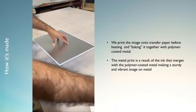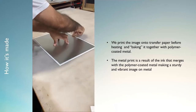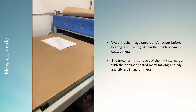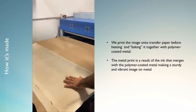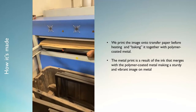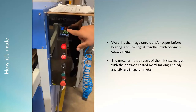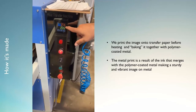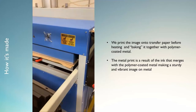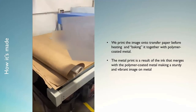Here you can see that he's taping down the metal to the paper so it doesn't move when they're being pressed together with heat. He's putting it into the machine and covering it, making sure the image doesn't get scuffed up during the process — really well cushioned. For our prints, we have specific temperatures and specific times as well, so it's like baking a cake. But instead of baking ingredients for a cake, we're baking a polymer-coated metal with transfer paper, and after the time is done, it results in your image.